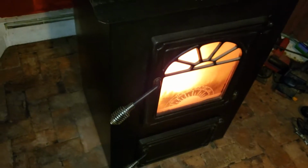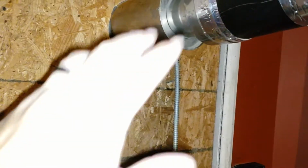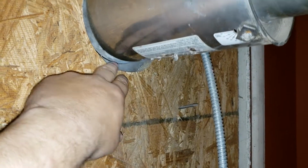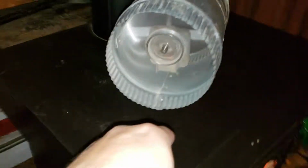But put that down. Ended up bringing this thing in here, set it down, cutting the stovepipe or chimney. Ended up running that all the way up. This is where I screwed up. Ended up running it out here, and as you see, it was supposed to be down here, but I had to cut more up there. What happened was I didn't level it off. Got to level it off. Put your level this way, then your level this way to make sure it's 100%.